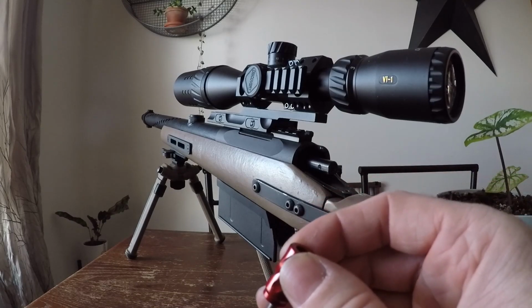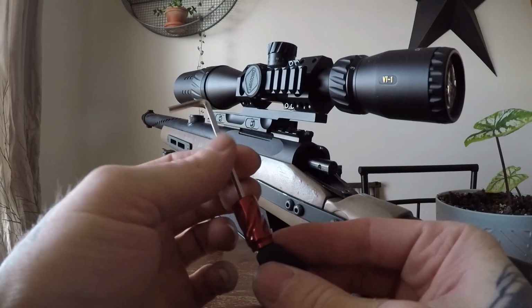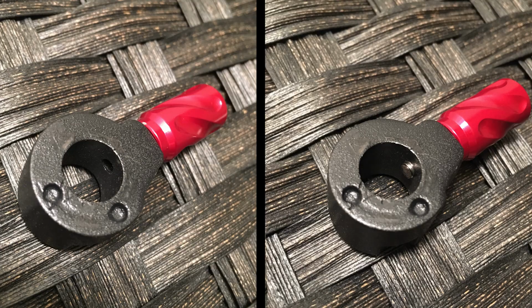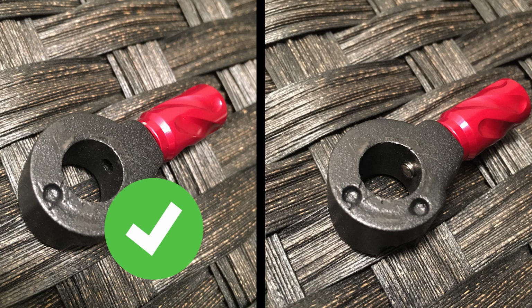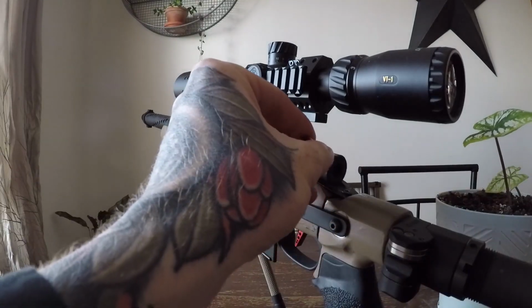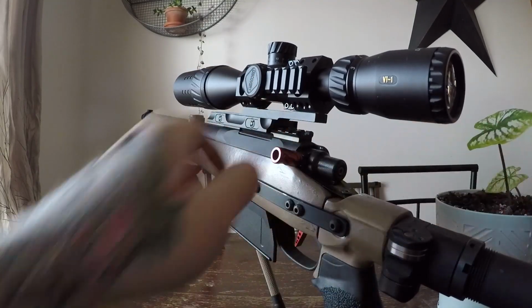You need a screw that fits inside of the knob, and it obviously needs to match the threads you tapped. Make sure that your screw is the proper length. You want enough threads to firmly attach the knob to the base, but you do not want the screw to be too long and be sticking down right here. So, bolt your knob down, throw your new handle on, and tighten your end cap.